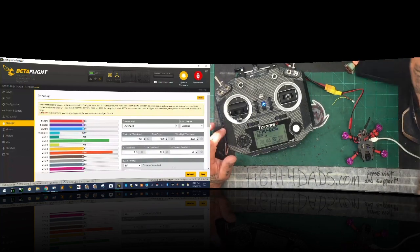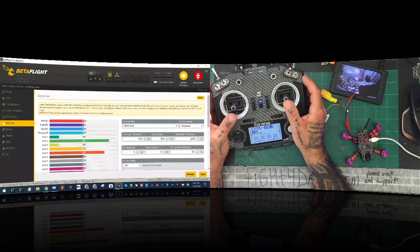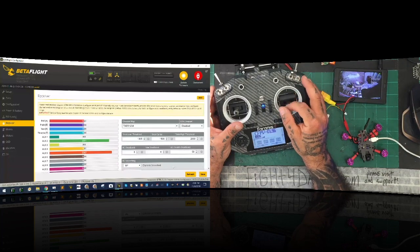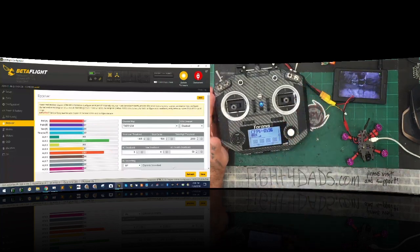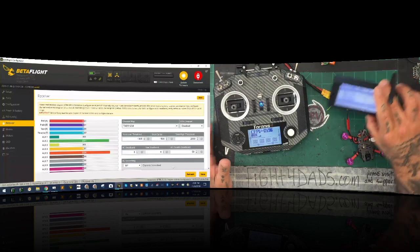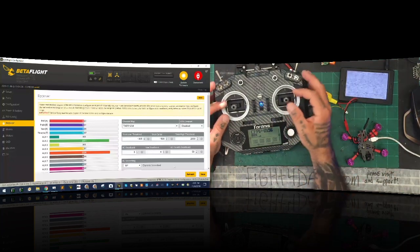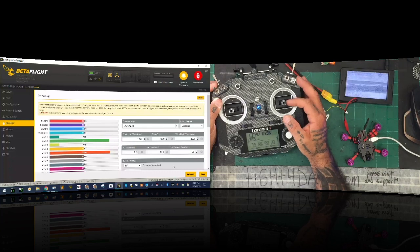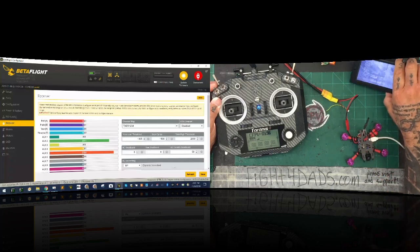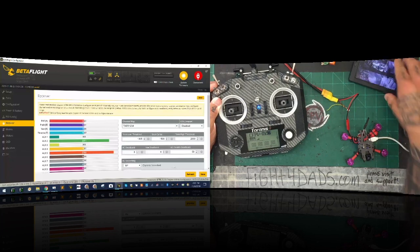The reason I'm hurrying is I want to turn my VTX off because it's going to get hot really quick. I'm going to go ahead and enter my VTX mode, go down to my features, go down to TR and down to pit mode. I'm going to put it in pit mode. Now my stuff will stay calm. I should be in pit mode now. Let me do a scan real quick — far the scanning looks good, so I think we're going to be okay. We're going to put it at a very low power level. Pit mode is on and looks good.